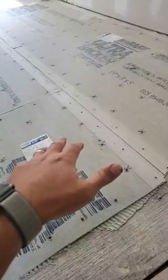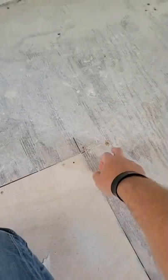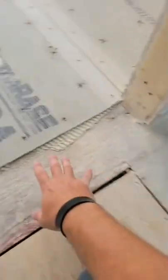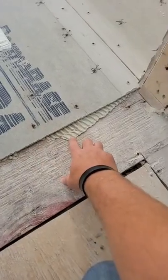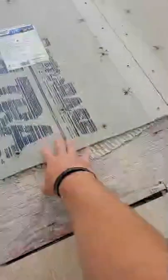You can see it in a lot of older houses nowadays - there's always one or two tiles that are cracked. It's not all over the place, but it does happen. So to prevent that, make sure your contractor screws into the subfloor into the stud so it's nice and secure - no bounce, no movement. And the same thing when they put the Hardie down: make sure they put mortar underneath it. Then mortar goes on top again, then the tile. So you'll have three layers - subfloor, mortar, cement board, mortar, then tile and grout - giving you a really firm, strong base with no cracking.